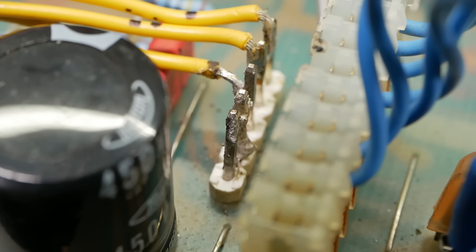So I think the plan is to remove this output board and replace the PCB sockets with eyelet sockets, then hardwire everything on the output section — just your screen grid resistors and grid stoppers, mounted on the valve sockets just like a Fender. For the phase inverter, we've got a screw that could also mount a tag strip on the side, mount the components for the phase inverter to two tag strips, then hardwire everything to the output sockets and she'll be golden for a very long time.